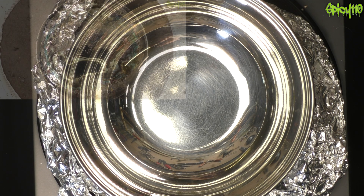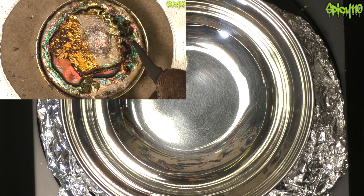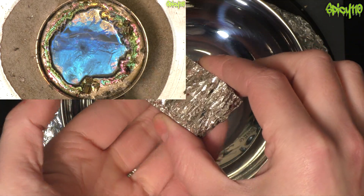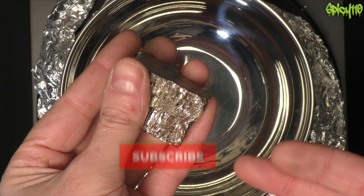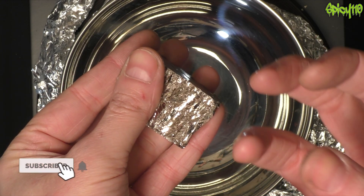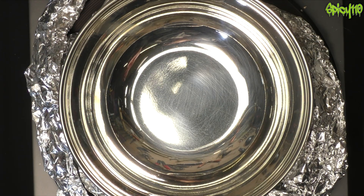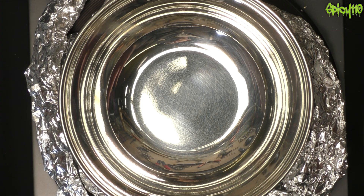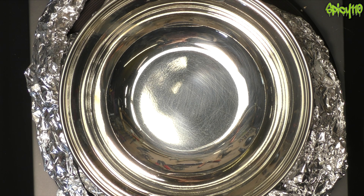As you may have seen recently, I've done a couple of videos playing with bismuth, trying to grow larger crystals. This is bismuth itself in its raw form — it's a metal very much like lead, melts at 271 degrees C, and when it solidifies it turns into some amazing and beautiful crystals. I've been experimenting; check out those other two videos. Today I'm not messing around — I'm going to melt everything I have. I think I just needed more mass, so I've got over two and a half kilos of bismuth ready to melt.